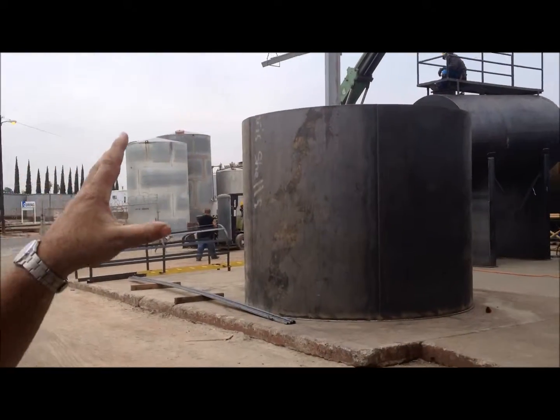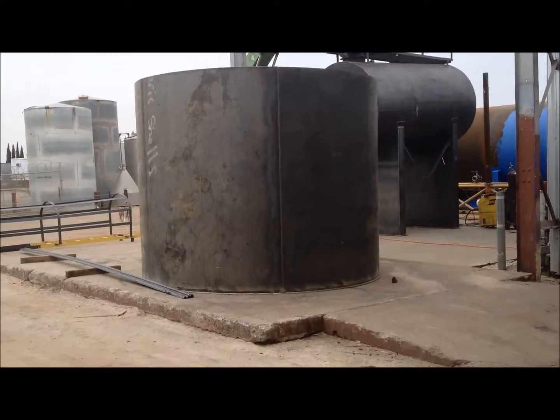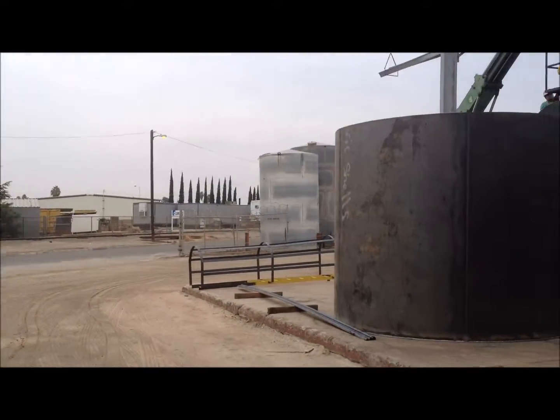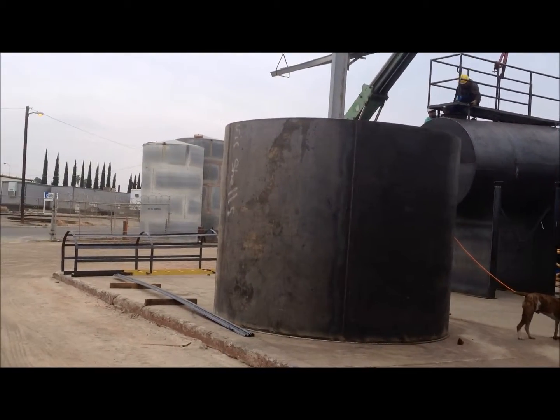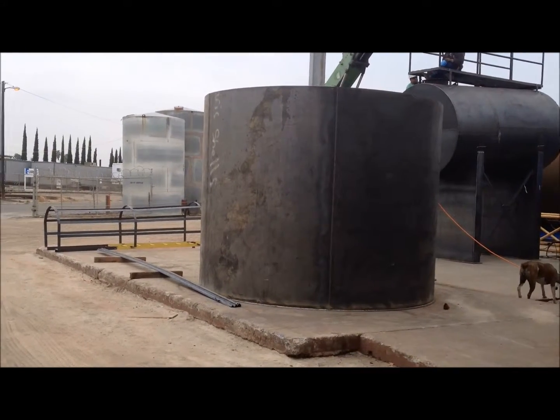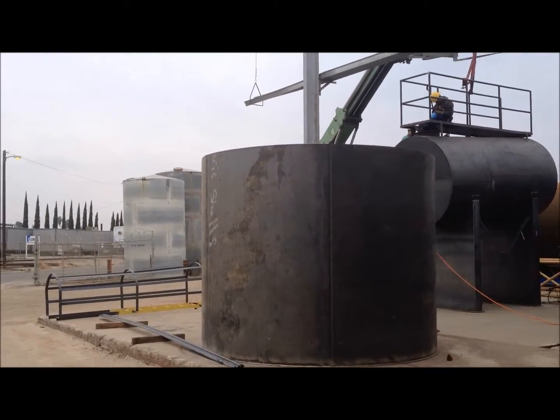This is another polyethylene-lined tank we're doing right now. This one is going to have a little bit of pressure in it. It's going to be used for an anaerobic digester, which is hot and corrosive. The company is Hildaris Dairy. Dairies nowadays are doing a lot of generating their own energy using methane and similar gases. So we're building a pair of these for Hildaris Dairy with a very heavy floor and a very heavy roof, and it's able to handle 10 PSI.